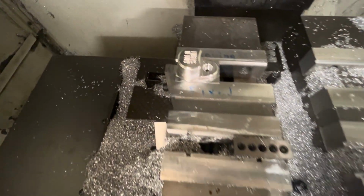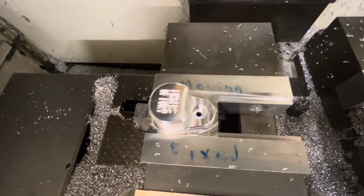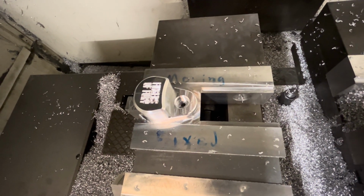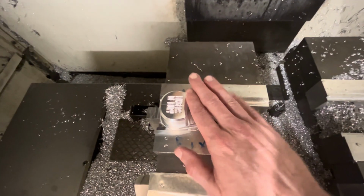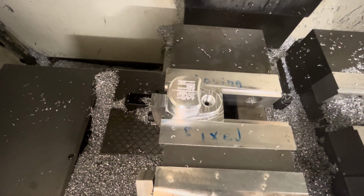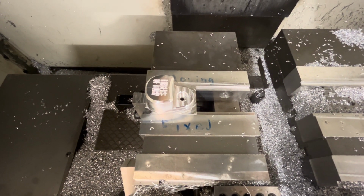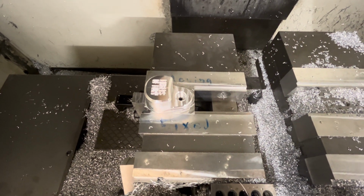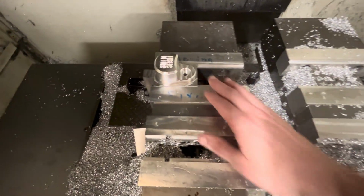For some reason that I'll figure out, this engraving is a bit deep. I don't think that's showing up on camera, but this is the first prototype coming out of the machine. So it doesn't matter, but I can also skim cut 5 or 10 thousandths of an inch off, and that engraving will look perfect again. So I definitely won't notice it when I'm using it, and this is my personal prototype that I'll keep anyway. But that's what that looks like, op 1.